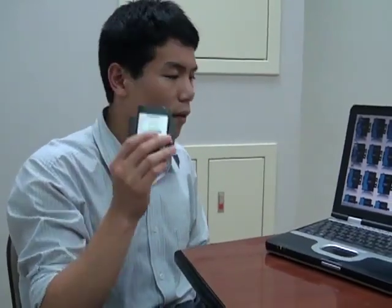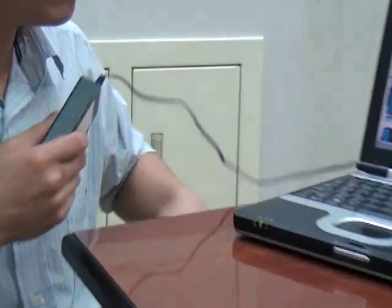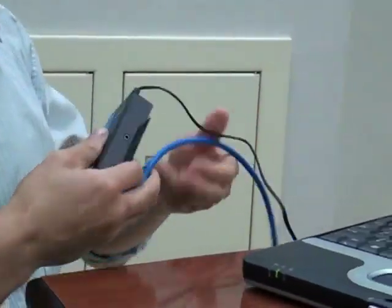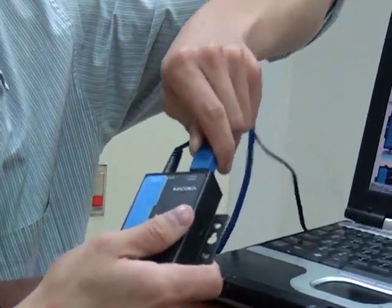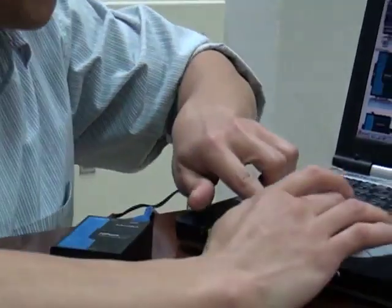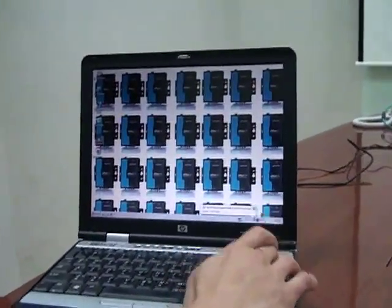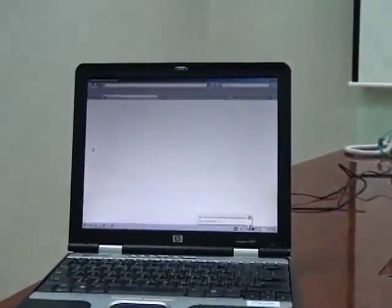Also, make sure you have a laptop that's set up to be on the same subnet as this IP address. So once you have that — you've got the note of the IP address, you've got the laptop that's set up — then we can go ahead and enter the setup wizard. Powering on the NPort, connecting it by Ethernet to my laptop, and I'm opening up a standard web browser, which is how you're going to access the setup wizard.